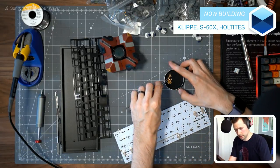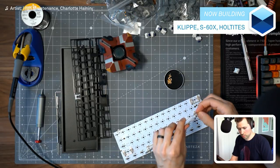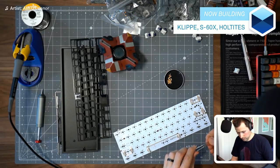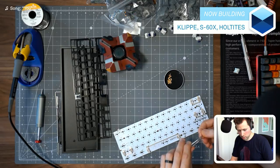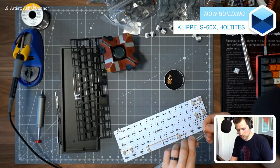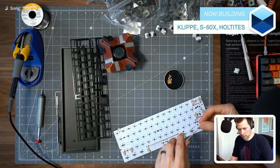Okay, we got about six switches left to go. And then the fun part of trying to solve that slash key. If I don't run out of time. Come here. Oh, I also need to, yeah, okay. I also need to test which pads the function key and right spacebar go into. Because again, I never remember exactly which ones it is to create the layout that I want, which is the short shift on the right with a function key to the right for layers.